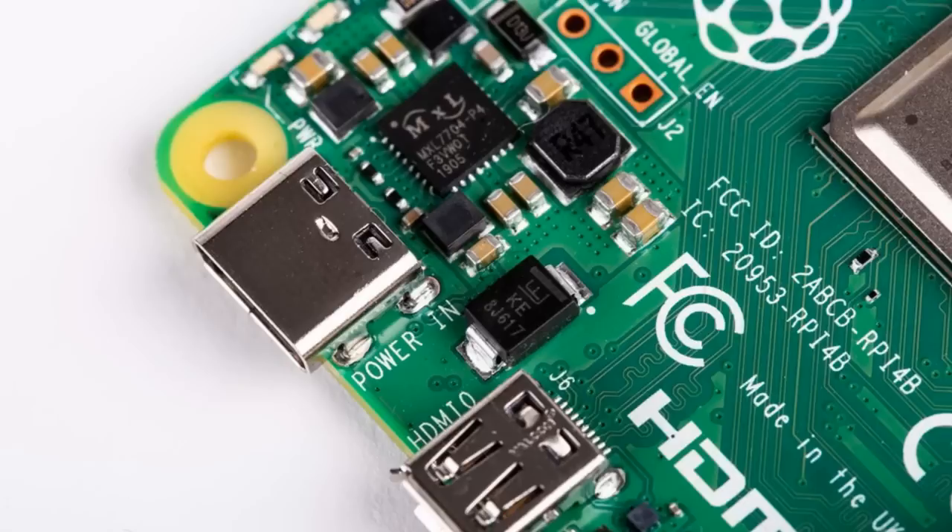You may want as much as three amps for this board, especially if you add external displays, hard drives, or devices. They upped the maximum power requirements, and now the port is a USB-C port because micro B tops out at about 2.5 amps — micro B only has one conductor pair for power and ground, whereas USB-C has four. So you have many more wires, less resistance drop, and you can supply a lot more current. Everything is also kind of moving to USB-C, and there will be an official Raspberry Pi power supply carrying three amps.